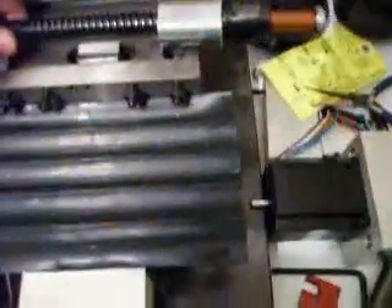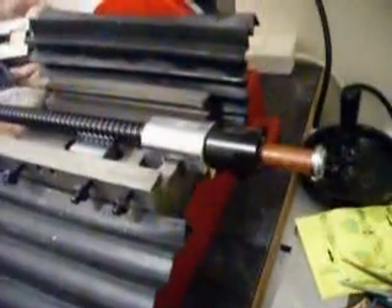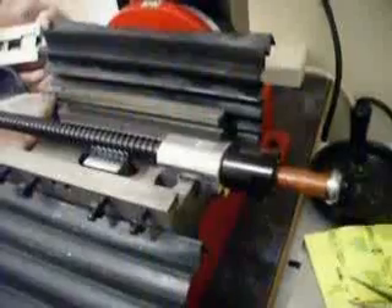Let's get this last axis up and running and back in place. First of all we need to take our new lead screw, lie that across the bed, and drop it into place. Now that it's dropped into place, I'm going to need to hold it flat to the saddle, then tighten the two 3mm Allen keys that we've got under there, which we released earlier in the tutorial.